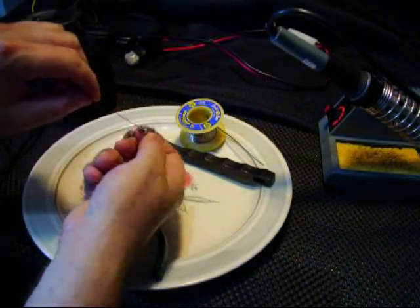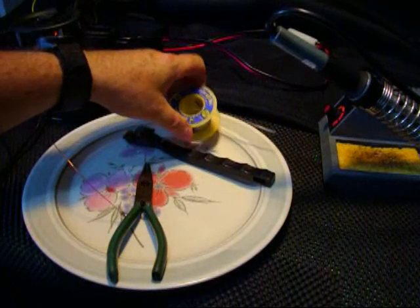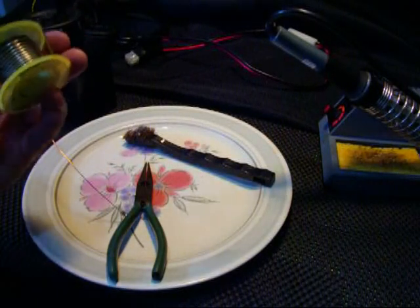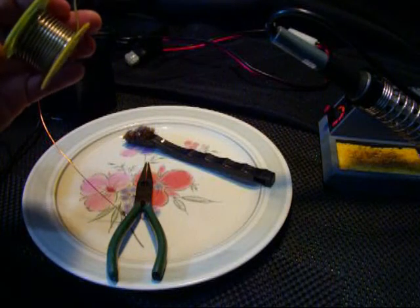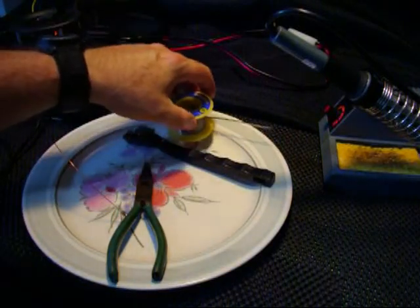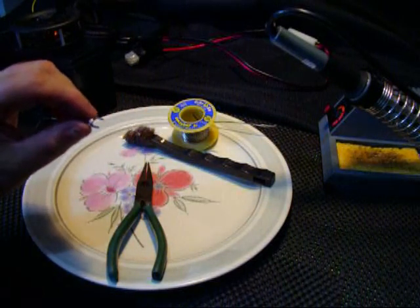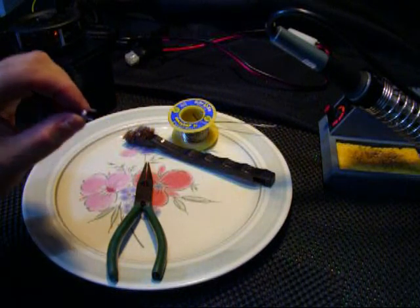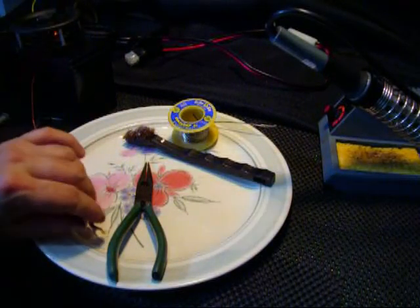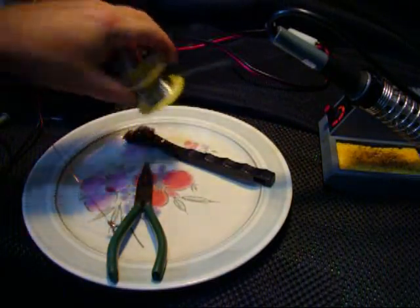I like it because the back is full of solder — I think that's going to be fine. When you're working with electronic parts and connections, you'll want to use a solder that has a rosin core in the center. Rosin core helps with heat transfer, and it also helps the solder melt quicker and adhere better to the work. So you need rosin core solder. This is a lead-free solder, and it's not a real tiny diameter, but it did the trick.